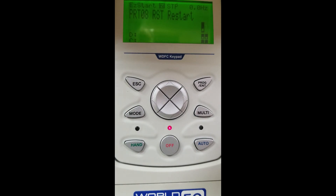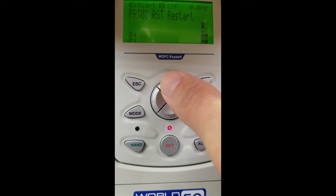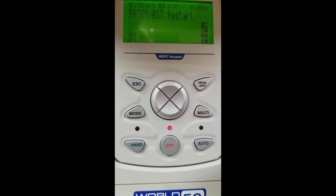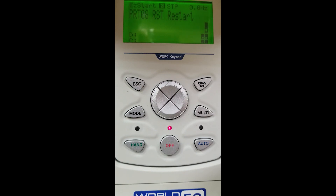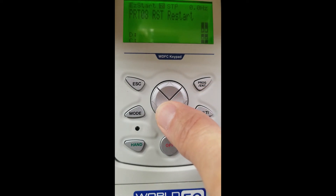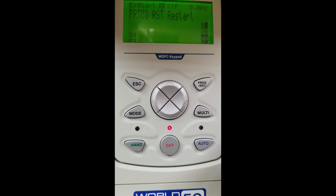Our restart function. As you can see, we have a couple of bits on our screen. The right bit is flashing — in restart mode, the right bit is under voltage, and it is currently set to off, so if our unit had an under voltage it will not restart. We can change the bit so it would restart itself. In our situation we want zero restart, so we are going to put it back. The next bit to the left is all other trips — factory default off. If we wanted to change it, we use our arrow up button, and all other trips would then automatically be reset. For what we are doing today, we are going to turn that off. Please see the instruction manual for more information on this parameter. We are going to hit enter to save.